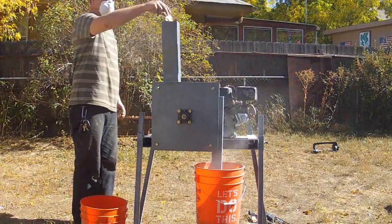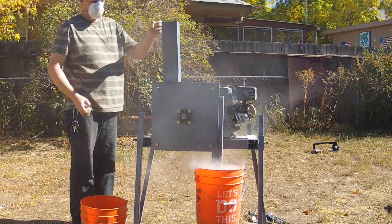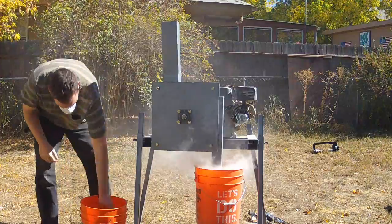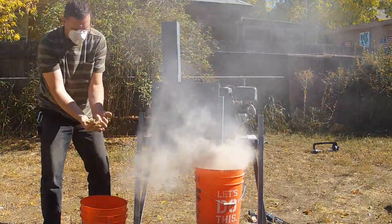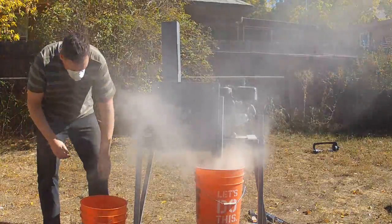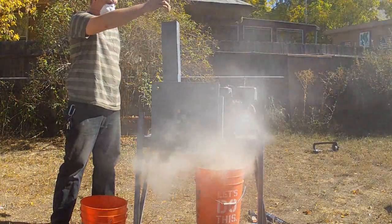Let's take a look at the mill actually running ore. As you can see, it pulverizes rock pretty much instantly. The trick is you just can't feed it too fast. It would be possible to create some sort of vibratory feed mechanism, though. If the whole system was automated, it wouldn't take longer than five minutes to process a bucket of ore, and then the main problem would be the constant replacement of the chains.